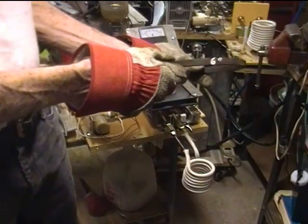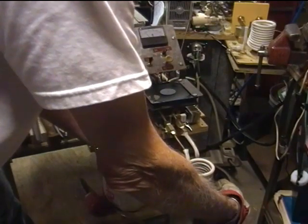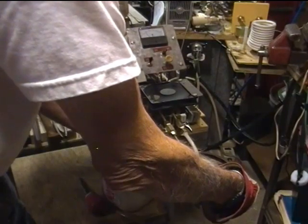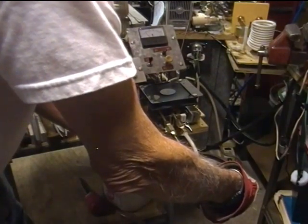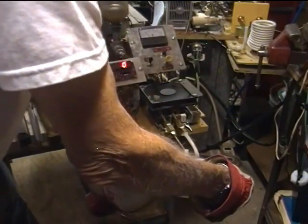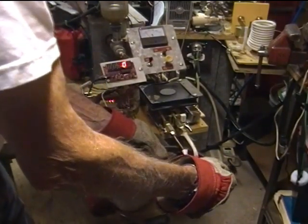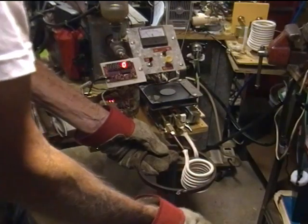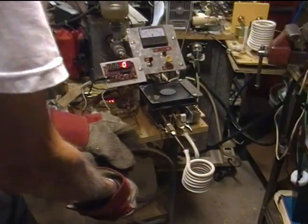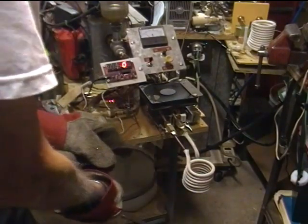Next, we have a 6 inch diameter steel ring. Even with the bottom, about 1 amp. Now moving it up so it's centered on the work coil — we have 7 amps. If I move the part so that it's touching the edge of the work coil, which is insulated of course, I get 8 amps — that's like just using a plain steel bar. Doing it the other way, I only get about maybe 1 amp of gain.